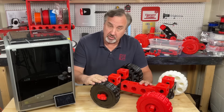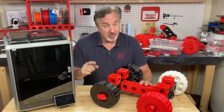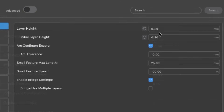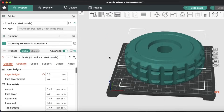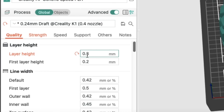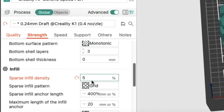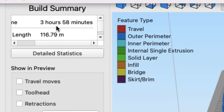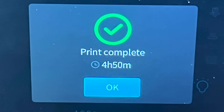Next I needed a couple of these wheels, and on the Ender 3 this would have been an overnight print. In Creality Print at 500% with 5% infill and 0.3 layer height, it sliced to 6 hours 58 minutes. In Orca Slicer using a 0.24 profile changed to 0.3 layer height with 5% infill, the time was 6 hours 53 minutes. In Simplify 3D the preview showed 3 hours 58 minutes, though it actually took 4 hours 50 minutes — still at least an hour faster than Orca or Creality Print.